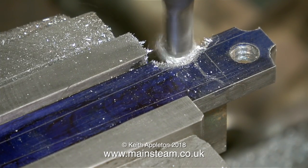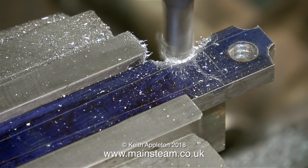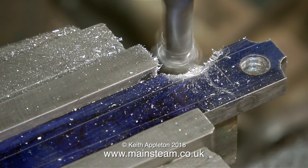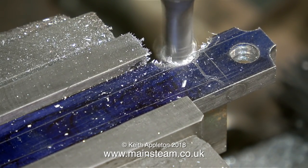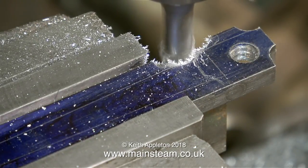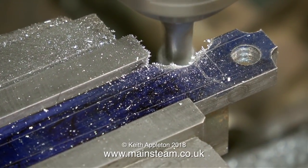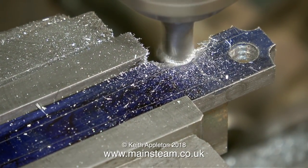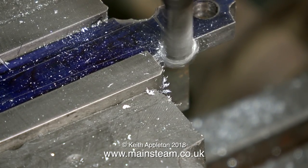Now I need to take a cut towards me. Once again I've lifted the milling cutter and I'm taking a succession of very fine cuts — well, not that fine, but not heavy-duty ones. As I lower the position of the milling cutter, it's much more likely to chatter when it gets to the end of the travel. In common with many metalworking operations, you do need a delicate touch. A noise like that can cause major problems, not to mention you will not get a very good finish.